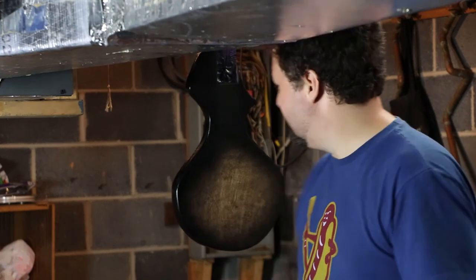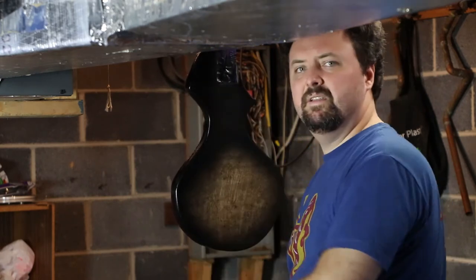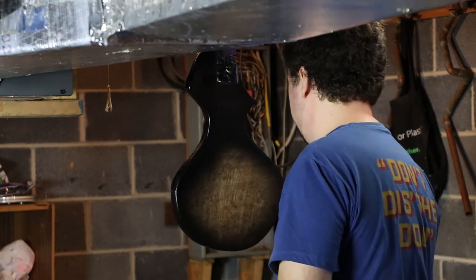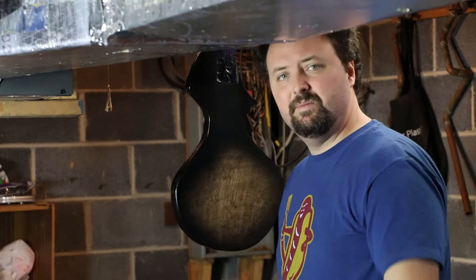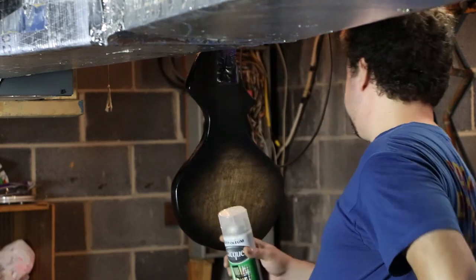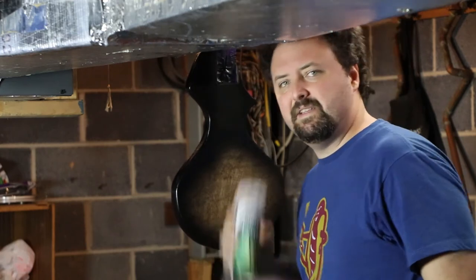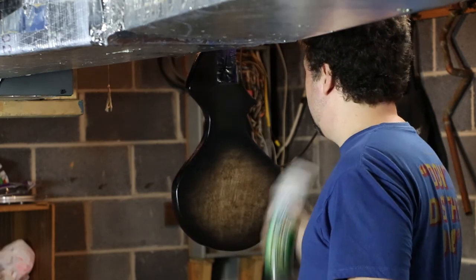So I've dealt with this a few different times. The black on the front, where I did the soft spraying, not here at the top where it's solid, but where it's speckly to create the gradient effect, it's chalky. It rubs off. I'm not sure why that keeps happening. Someone who understands this stuff better, tell me in the comments, please. So what I'm going to do is go back to some clear coat. I'm going to hit it real gently, because I believe from past experience what tends to happen is it sort of melts the powdery lacquer.